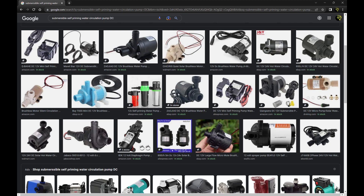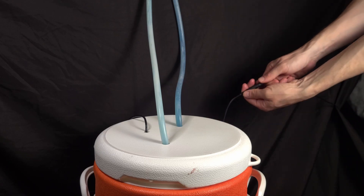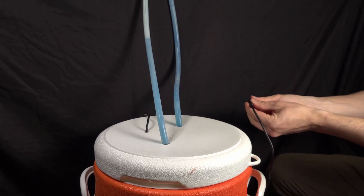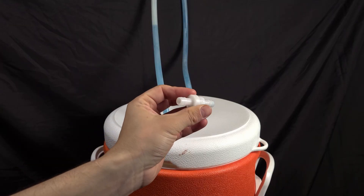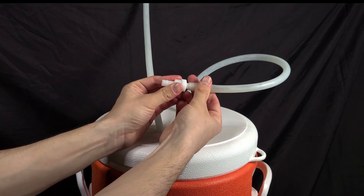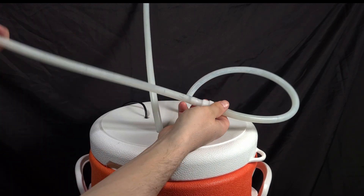When selecting your pump, I would recommend getting a self-priming model. This pump is not, so I had to find a workaround for the fact that every time the unit switched off, the coolant would drain from the tubes and pump, and when switched back on, the coolant wouldn't recirculate. The solution I came up with was to add a cheap plastic one-way valve in line with the outlet tube of the pump. That way, when the pump shut off, the water level in both the inlet and outlet tubes stayed still and wouldn't backflow.